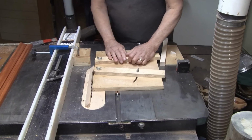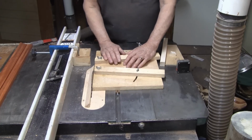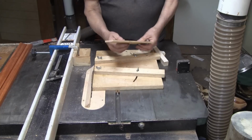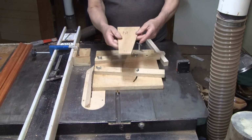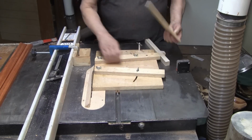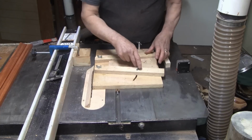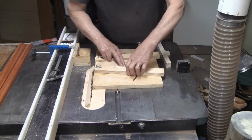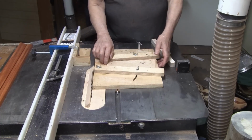Because the turning is so easy, I want to talk a little bit about my sled and my setup, because I've been asked that. I'm making 25 segments per ring. I had to make a special wedge to do that, and I was able to do that on my CNC mill. It's exact. But setting them up is no different if that's 12 or 24 or whatever. You get it up against here and you slide it down. You make sure those rails are against it the whole distance. If you're off a little bit, the segments will be off.